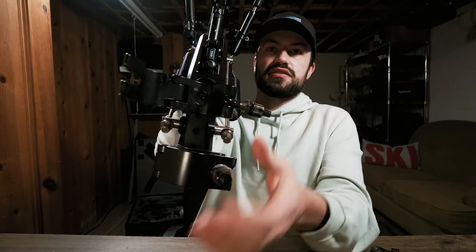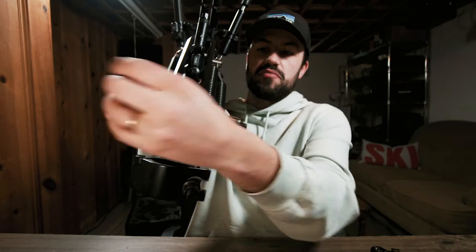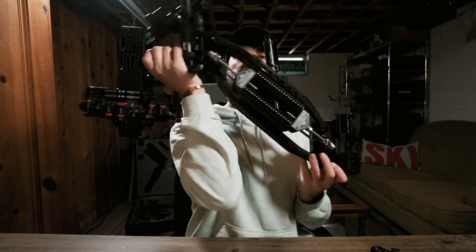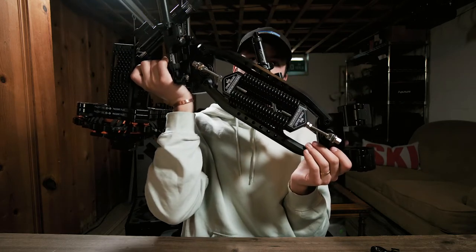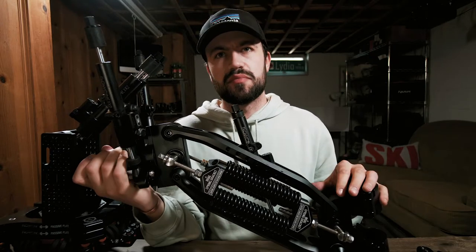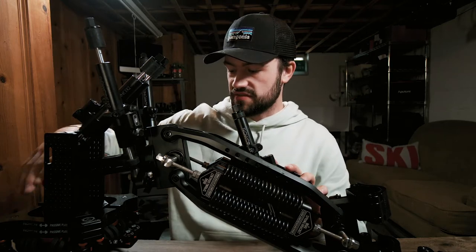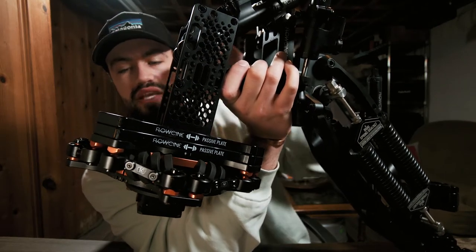So at this end you've got these swivel clamps. This is something you see pretty industry standard — it's actually a very similar clamp to what Motocrane uses on their base system on the roof of the car, and that just bolts straight into the back of the black arm. Now this is in its full upward position. Obviously we don't have it mounted on this side and we don't have a camera on this side to flex the whole suspension system. But what you want this to be is once mounted to the car this needs to sit about parallel with 45 degrees movement up and down. What that allows you to do is have maximum travel when hitting bumps on the highway, cornering, swinging your payload or all around. You can adjust the damping depending on the weight and the spring tension depending on the weight of the camera that you're hanging off of this end.